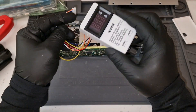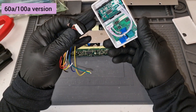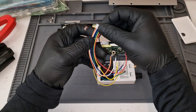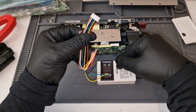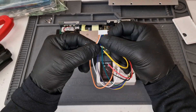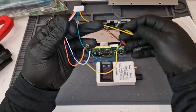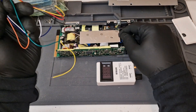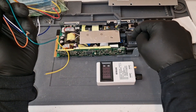I bought this controller as a 60-amp version but I'm going to decrease the current down to 50. The wires are always the same color for this version. There are seven wires, and the green one in the middle has an extra wire — this extra wire is going to go to the positive wire of the fan connector.